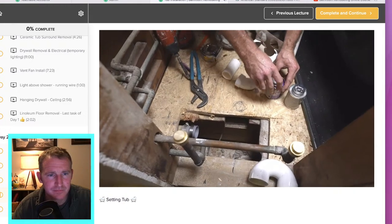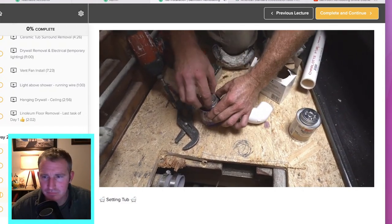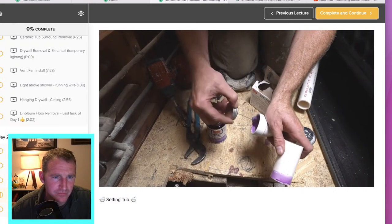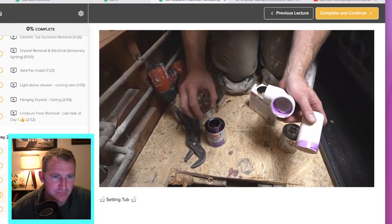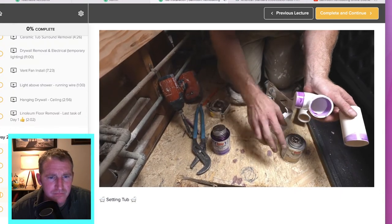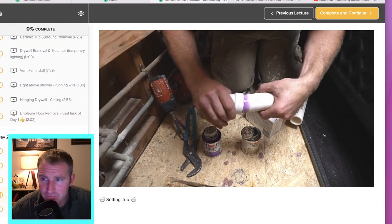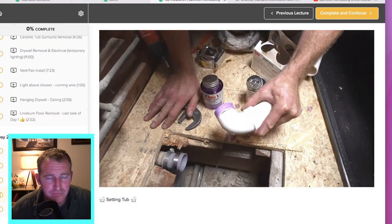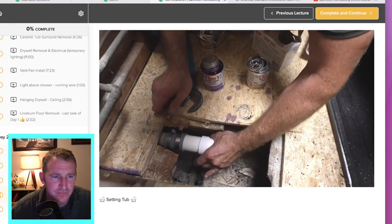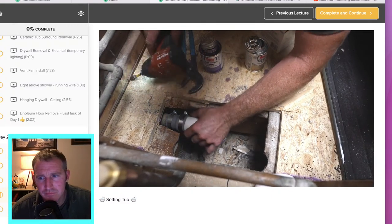You want to use a purple primer and then PVC glue for PVC fittings. You just need the primer on the fitting and on the hub. I'll go ahead and prime this portion outside of the plumbing area — so at least that's already primed. Then we're going to add some glue to each side. I always like to do a twisting motion, just hold it for a few seconds, and connect the pieces together. That's nice and tight.